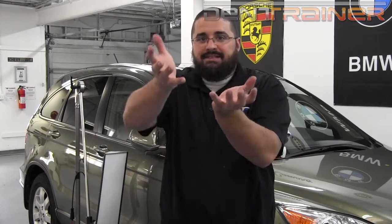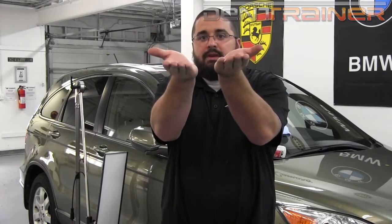At this point it's basically just rinse and repeat. I'm in an exchange where I'm pushing up some little lows and then tapping down some highs, trying to bring the dent up with balance — push here, tap here, or you've got a little high here, tap here, push here. Bringing the entire structure of the dent up nice and level.